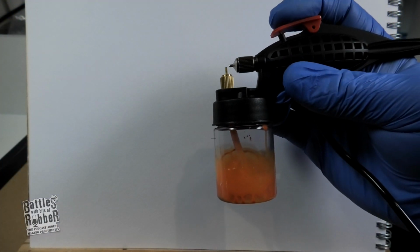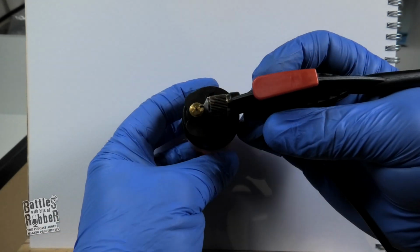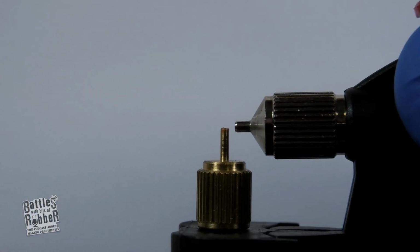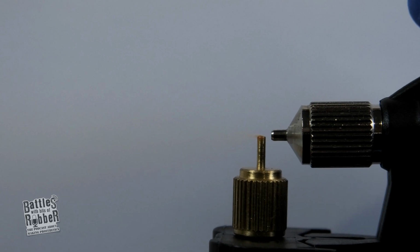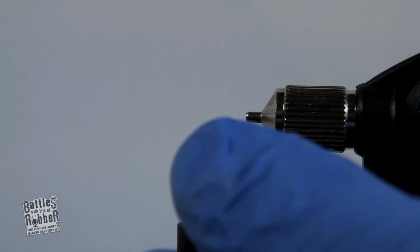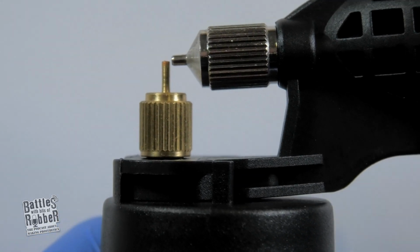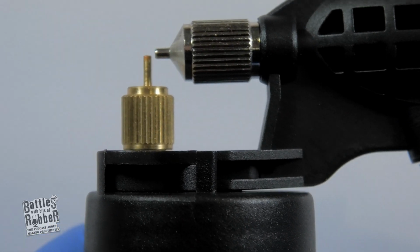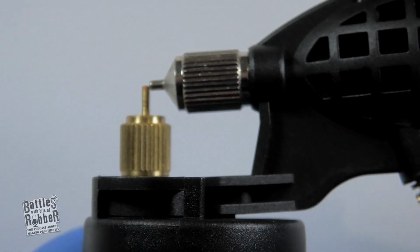So one thing I've noticed with this is the amount of precision required to get that lined up. So if I show you the very top here, nothing's coming out, but if I move this down closer to it, you'll see that it does come out. So it's quite critical, the placement between these two shapes, and obviously this being plastic, it can kind of move around a bit, so you may have to sort of do something like pack it out from underneath to lift that up so that it's in the right position to actually blow right across the top.